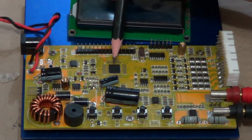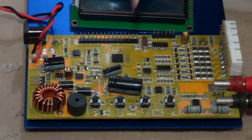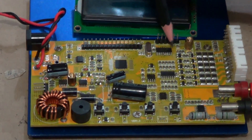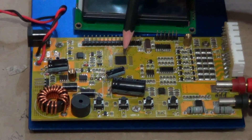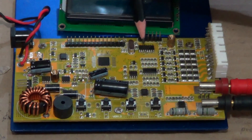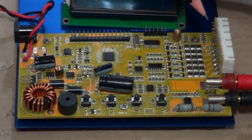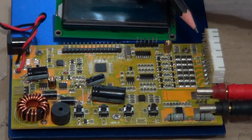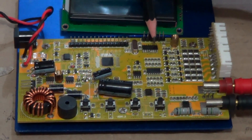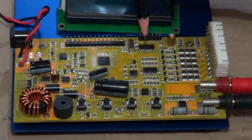This is the Atmega controller, which has the program for charging the LiPo battery and various other batteries. This is also the multiplexer. The multiplexer takes the cell voltages and sends them to the ADC of the Atmega controller. If anything is wrong with the voltages sent to the Atmega controller, the IMAX will not respond properly, and hence a case of over or under charging could occur. In this case, it was found that the multiplexer, which is a 4051, was faulty, and replacing it resolved the problem.